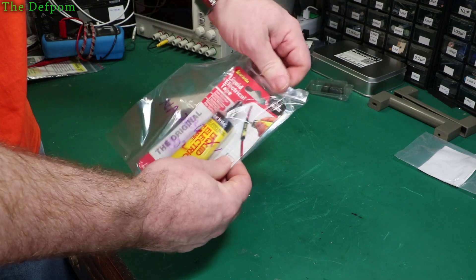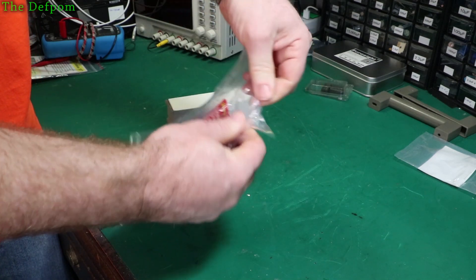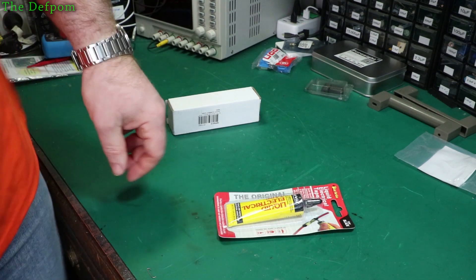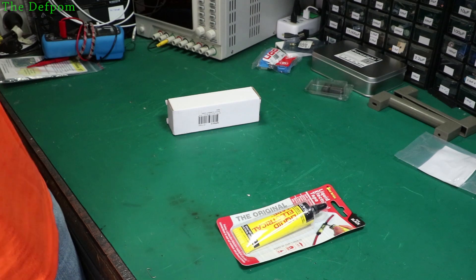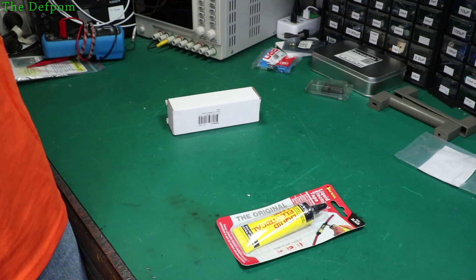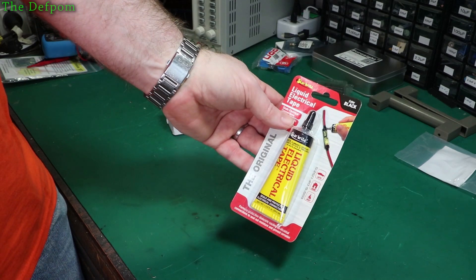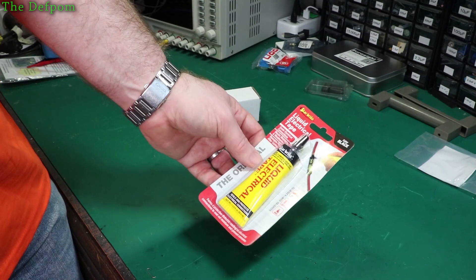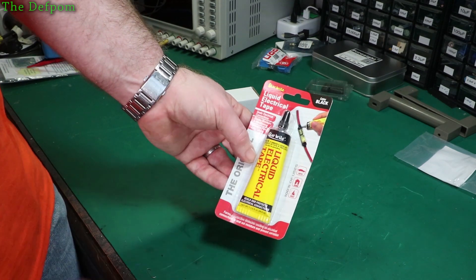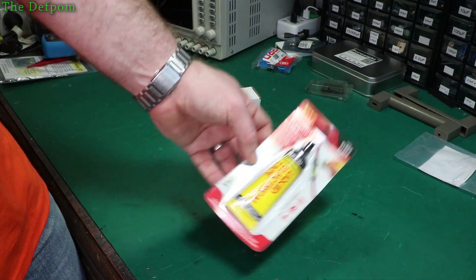So I've got some more of this liquid electrical tape. I use this for sealing things, or sticking labels back on sometimes if they fall off — that kind of thing. It's very handy. This is my last tube and I've had it for probably about six months, so I should probably get some more. It's handy stuff to have with multiple uses. This is basically PVC stuff — it's a liquid that goes to a solid. You can use it to seal weirdly shaped connections or things which you can't put heat shrink around because you don't want to strip it down to do it.